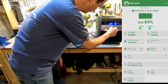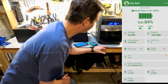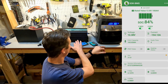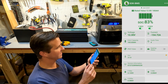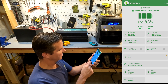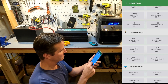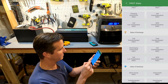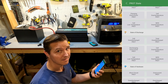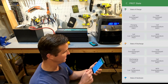Let's do four more minutes. I'm not even concerned about this thing going into any kind of over-protection. The app is showing we're pulling 154.8 amps from the battery and it's not shutting off. We should be getting an over-current protection state right now. I don't know if I should be happy or concerned — I didn't think it should be able to pull this many amps for this long a duration. But it is, and it doesn't care.